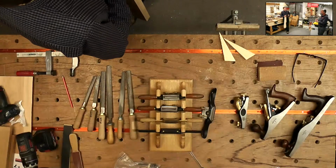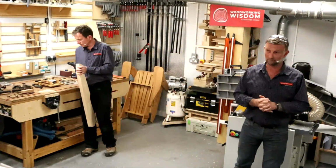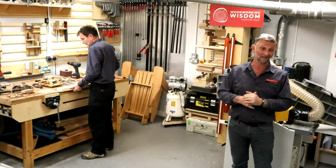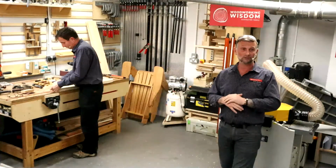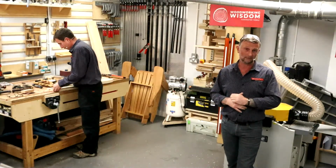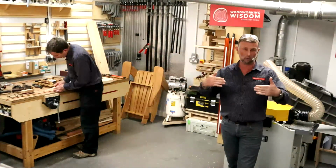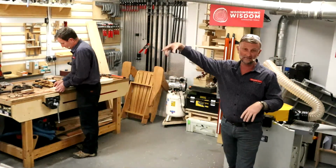Craig's, I think, got a question. Yeah, just a question about cladding the walls of a new workshop. Exciting times, a new workshop. We love it. The stuff that we used in our craft workshop, or Ben's workshop really, we used 11mm OSB with backing at every 400. All right, it gives good support if you're going to be hanging stuff like cleats.